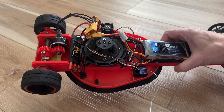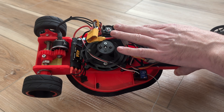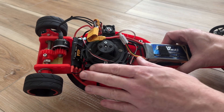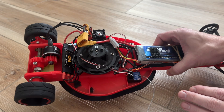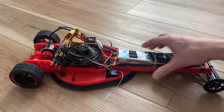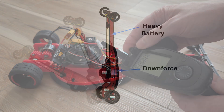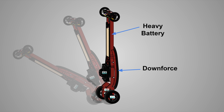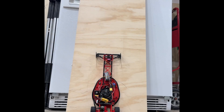This is the finished car - I know the wiring looks like real motorsports quality stuff, but it does actually work. The setup is simple: I have a six-channel receiver and two ESCs, one for the drive motor and one for the fan motor, which lets me control the fan speed with a knob on the transmitter. For the first test I wanted to drive it on the ceiling, but the downforce is too far back on the car and the front end would just fall off. I'm going to try it with a smaller battery and see if it'll drive up at least a vertical wall.